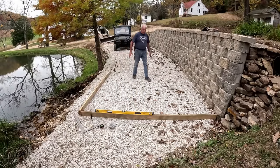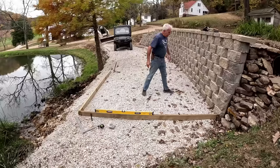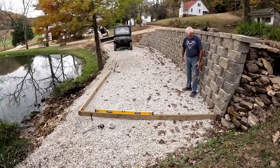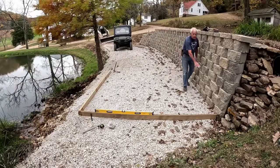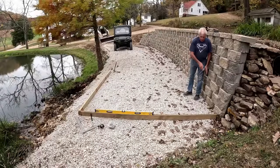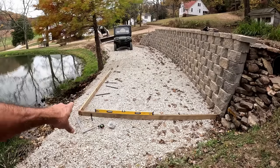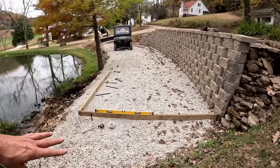I'm basically going to pour a 10 by 10, and the building I think is only going to be 8 by 10. The building's going to stick out a little way from the wall. That'll give us a couple of feet to walk through in case we have to do some maintenance on the outside. I'm planning to make a light swale down through here so that the water, when it rains or runs off the building, can run out and go around. I went ahead and drove in yet another stake over here on this wall. I'm going to drive in the other stakes, then go get the compactor, compact this area, and backfill it. Then I'll put the other wall up.